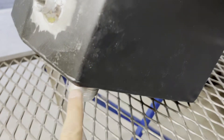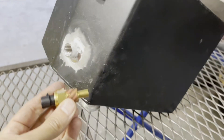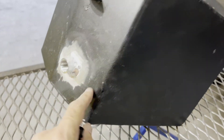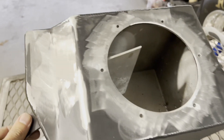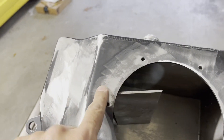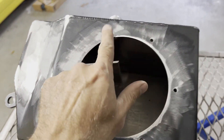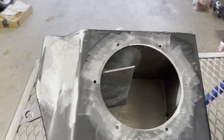We've got a bung welded in right here — there's the fluid exit. We're going to take a GM temp sensor, put it right in there, feed it into the MS3 and data log the fluid temps. I also noticed a big bump from a weld that had pushed up, probably wasn't helping the seal, so I went ahead and ground all the imperfections off the top of this cover.